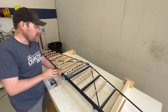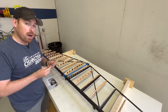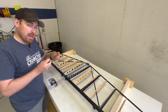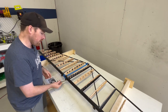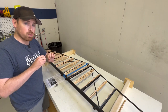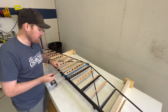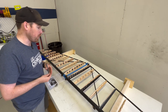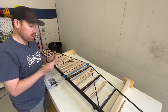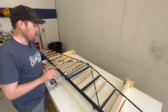I've taken the horizontal stabiliser out of the fuselage in order to install the trim position sensor kit. The first part of that is to install this position bracket — it's what makes contact with the sensor, and it goes on the underside of the stabiliser here. It needs to run horizontal with the stabiliser, so I've put this blue tape across that plane in order to position the bracket appropriately. I'm pretty much ready to install this and would bond it right now, except reading further through the instructions, I'm a little bit worried about doing that.